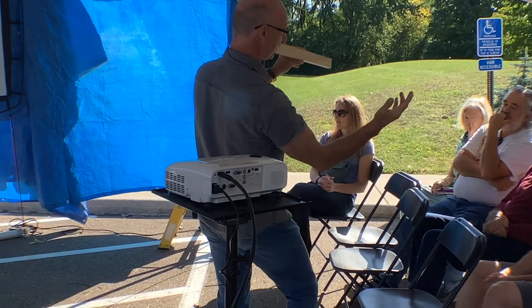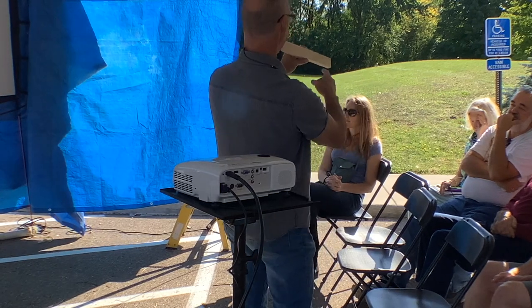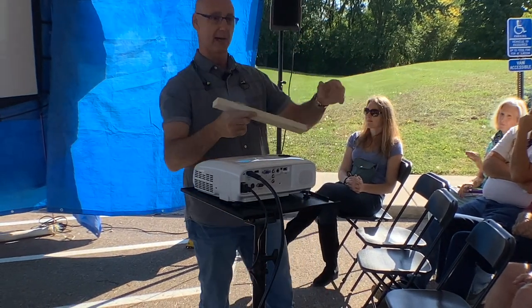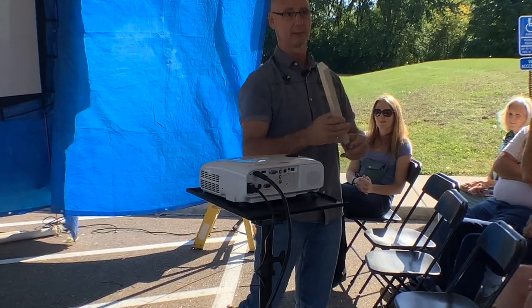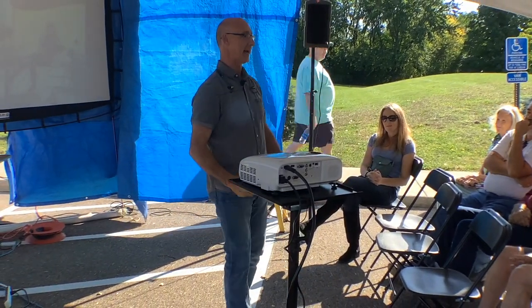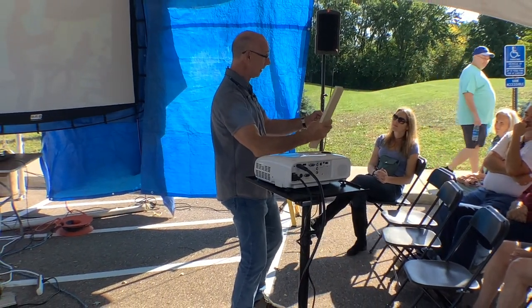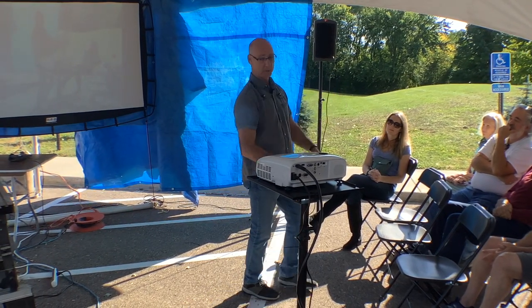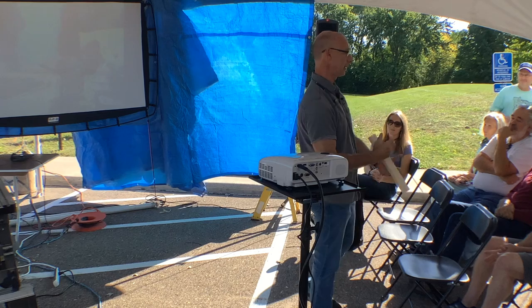So with a reversible shaper, one of the benefits is that regardless of the grain direction, we can control our feed direction by having the ability to reverse the direction of the spindle. So it gives us a few more options. But for most people, a router, you can't take an induction motor out of a shaper and use it handheld to cut dovetails on your jig. So for most people, a router table is still going to be a better thing.